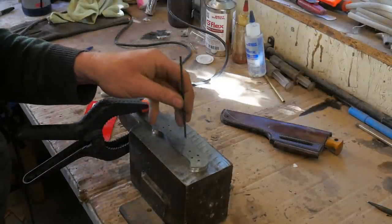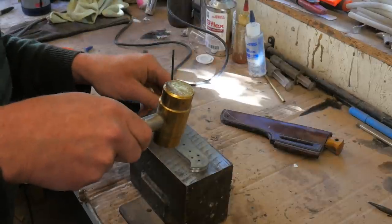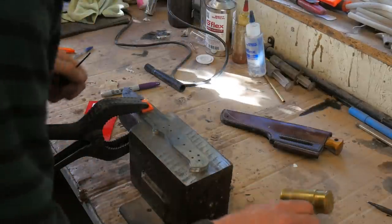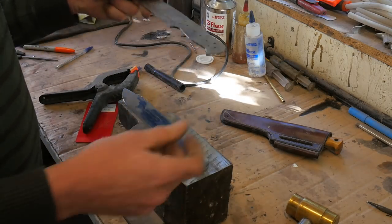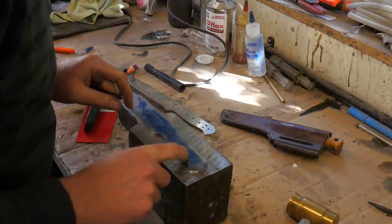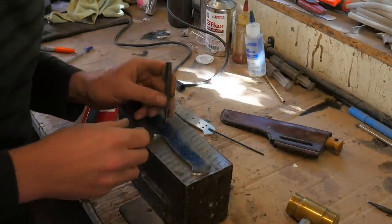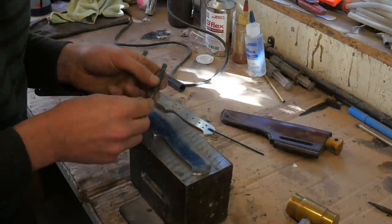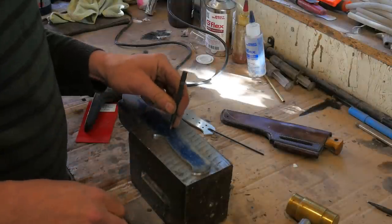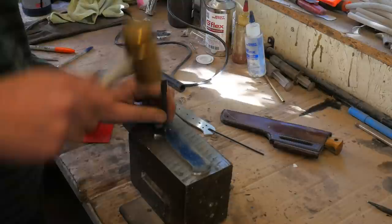What I'm doing at the moment is using what's called a transfer punch. This fits very accurately into the hole and puts a tiny little mark very accurately through the pattern piece. This is the actual knife blank I'll be working on — I've got two of these on the go. These are my camp knives. It's just a matter of finding those marks again; the marks are just deep enough to engage the tip of the centre punch. Place that on and there's a good centre punch mark.